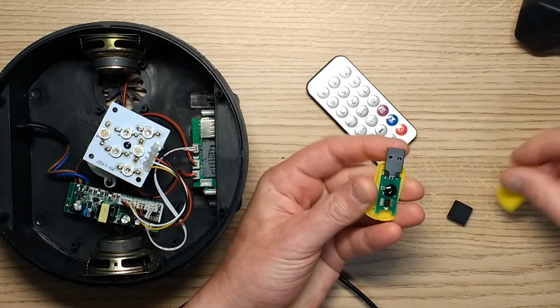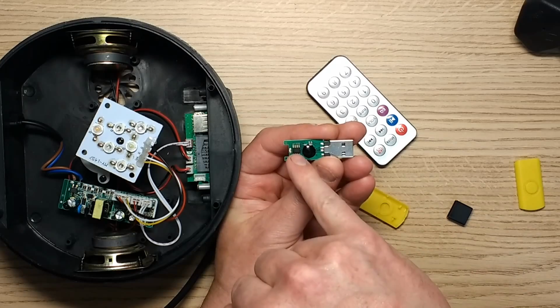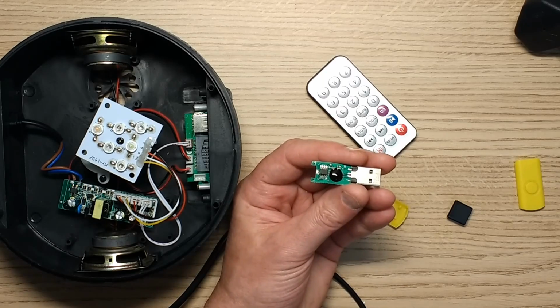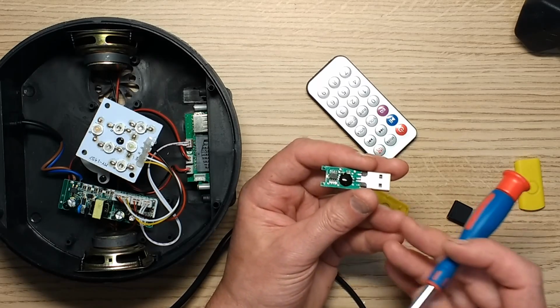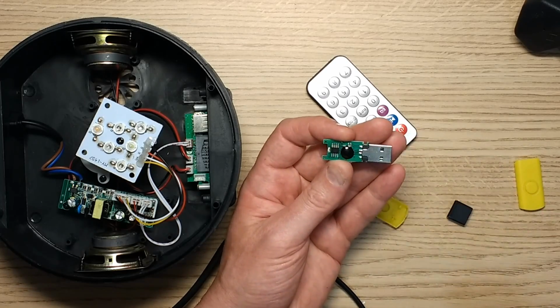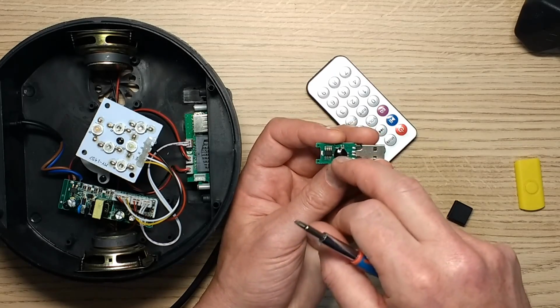Okay. So, the audio circuitry, it came with this and the remote control. And when you open this up, inside is a blob. It's got a chip on board. Plus, it's got this little chip here, and the number on that chip, which I wrote down earlier on, hold on, it's an MK25D80CTIG. Now, I think the key numbers here are 25D80C, and if it is what I thought it was, a really low-capacity serial memory chip, and I don't know what's under this blob.